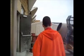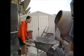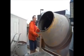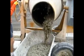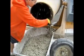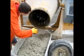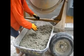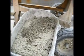Bring your wheelbarrow over to the drum mixer, positioning it directly under the bowl. Now come over here and drop the lever slowly. If concrete spills out, just mix it up a bit when you tip it over.